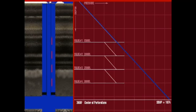During the initial unloading process, casing and tubing pressure gradients in the static loaded condition are equal. All gas lift valves are in the open position from the weight of the hydrostatic fluid in the tubing and casing annulus. As gas is injected down the casing annulus, it displaces the kill fluid through the opened gas lift valves into the tubing string and to the separator or storage tank. As the lift gas continues to displace and unload the fluid in the annulus, the pressure on the casing will continue to increase, maximizing the artificial lift capability.